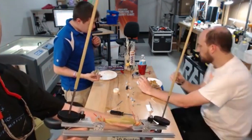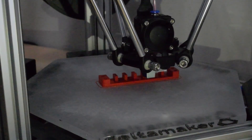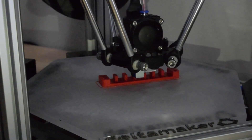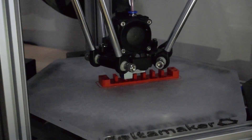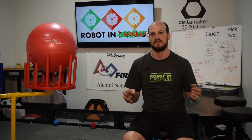Another thing that every team needs to do is 3D print supports for all of your electronics. You can get on Thingiverse and use your 3D printer — if you don't have one, try to find someone that does or go to a Maker Space. We used the Delta Maker 3D printer and printed up some little supports that will help your robot survive through a tournament. There are even guides on the FTC website to help you support your USB ports. If you can't 3D print, find a Maker Space or someone with a printer to support those USB ports.